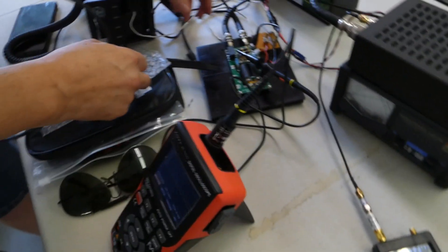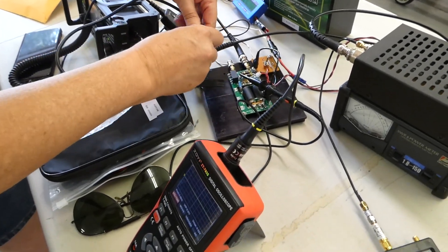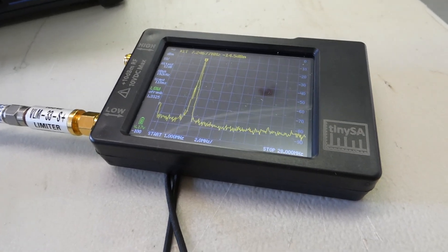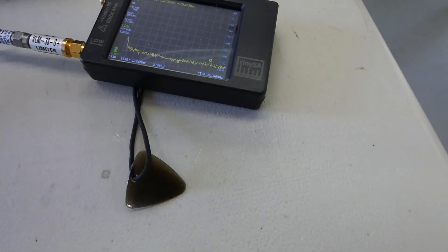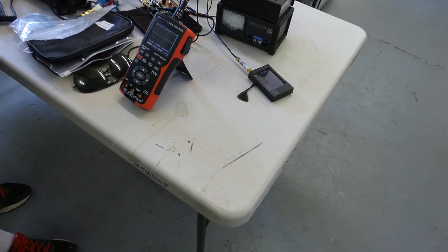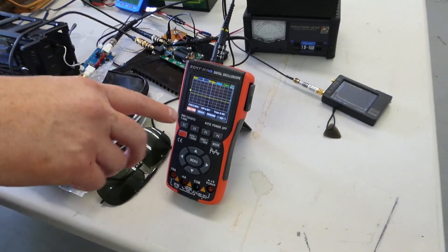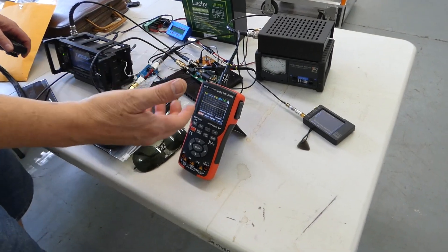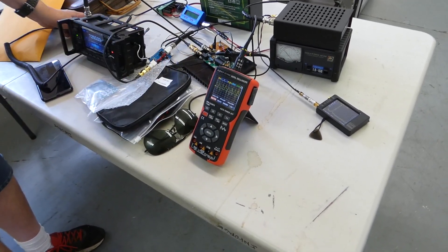And it should be a lot cleaner now — see? Now you're fine. I have some big spectrum analyzers and the readings are very close for this little thing — it's incredible. That's a scope DMM, about $70. It's rated at 10 megahertz, but I brought the frequency up to 50 megahertz. It's aliasing, but it still shows a response — it's good for troubleshooting radio stuff up to 50 megahertz, no problem. Let's show the drive to the FETs in the amplifier.